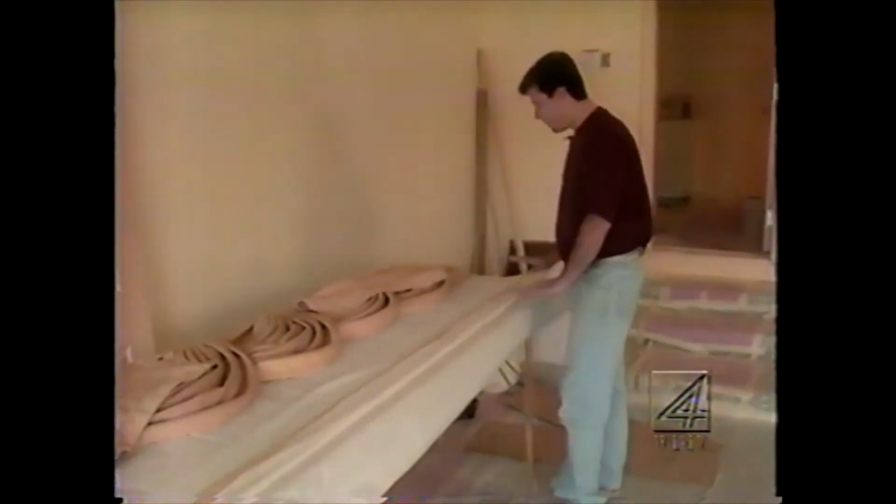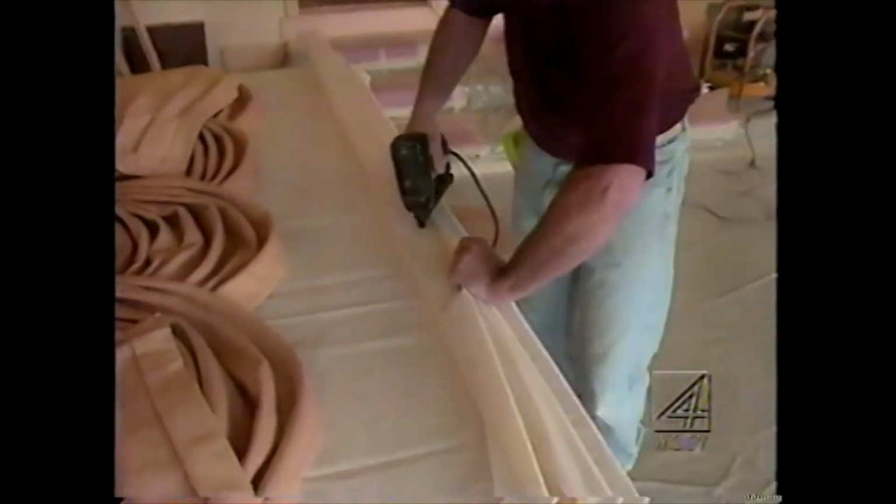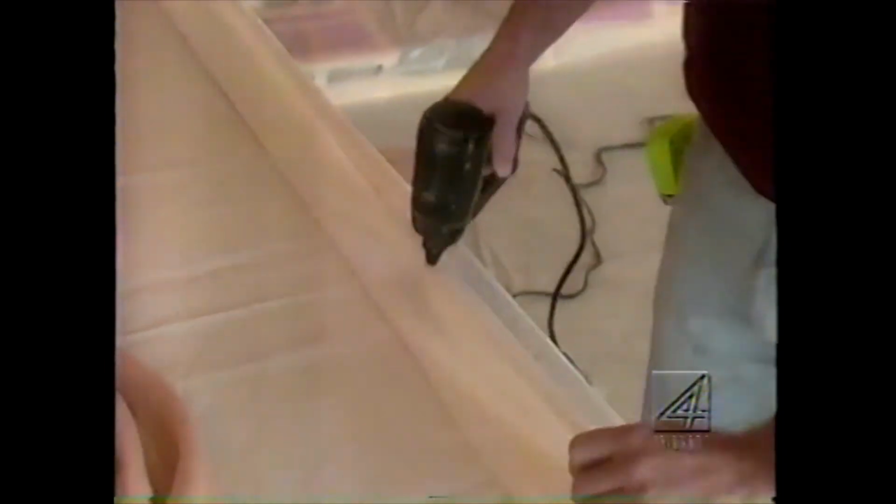And what we'll do is we'll wrap it with fabric. It can be a liner fabric, the same liner fabric we used on the back of the, or just some liner fabric that you get down at the fabric store. Wrap the whole thing in fabric and staple it on so that there's something there so that you can pin in your drapes, in case you want to move them back and forth. Plus, it gives the board a finished look, because we'll just use knotty pine for our board, because it gives us good strength, but this covers it over, all righty?